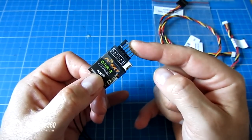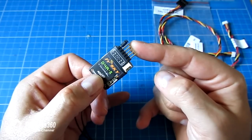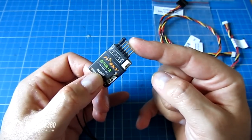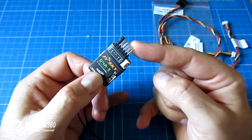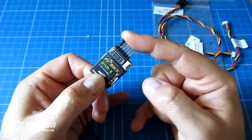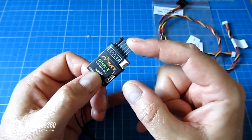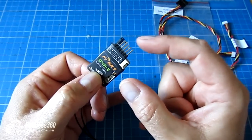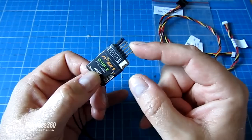The default setting for this was about 17 or 18 milliseconds, which wasn't quite long enough to get all eight channels. So if you're going to use a D4R2 with a flight controller and pump out all eight channels from the Taranis radio, you have to change the firmware to make the time the receiver has to send all PPM channels a little bit longer — increasing it from 18 milliseconds to 27 milliseconds, which gets rid of the problem.